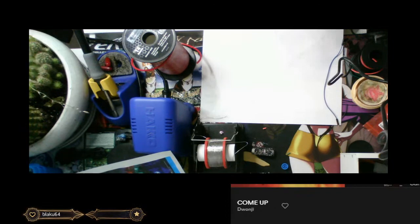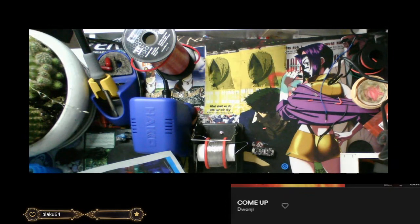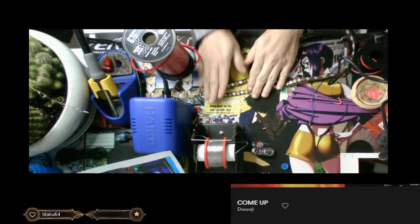I trimmed off a good inch off either side of my paper, and then I taped it down to the table. That way my LED strips would be hanging off the edge of the paper, and as I lined them up, I taped them down. I taped the tops and the bottom of the paper, and then I taped the LED strips down so the excess hung off and they wouldn't move anywhere. It made a kind of frame, so that when I got all of them on, I could untape the paper, slide it out, and be left with the LEDs like so, minus the soldered part.